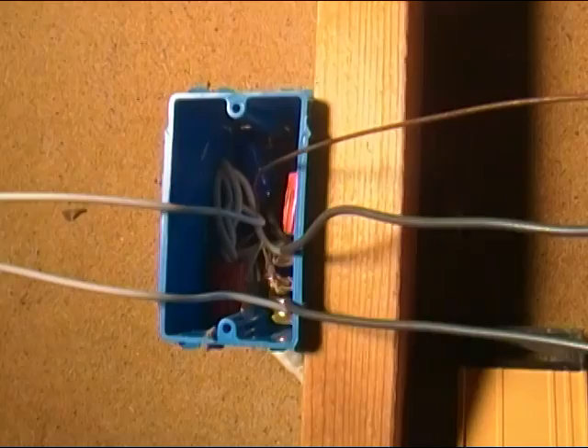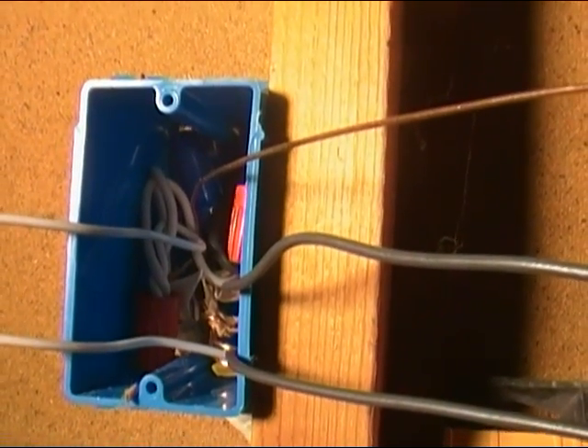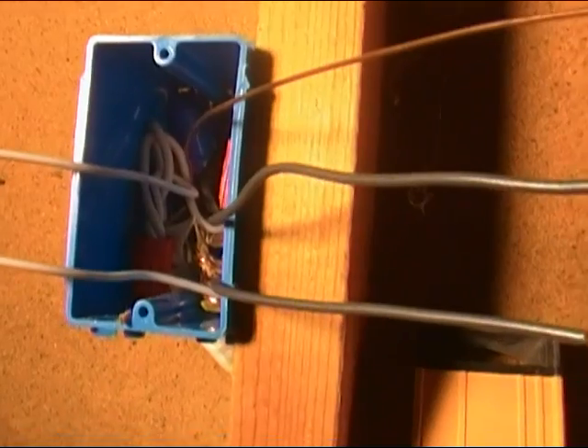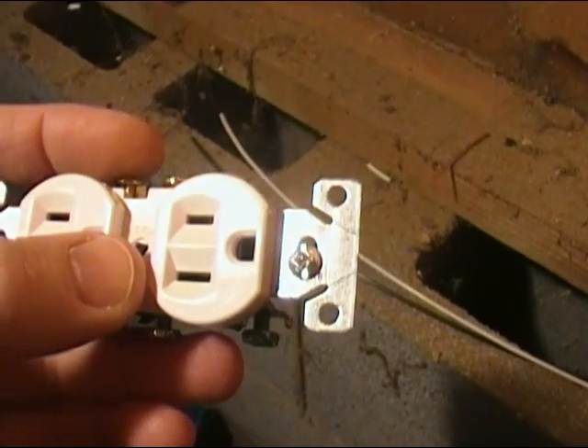What we've done is go into the box and first strip back the ground wire on all three of these wires. Then we cut a little extra piece of ground wire about a foot long, and we twisted the three ground wires together with that additional piece and put a wire nut on it, shoving it all the way to the back of the box. That connects all three ground wires and leaves an extra pigtail piece coming out that we can attach to the outlet — because on that outlet, there's a green screw where you need to attach your ground wire.